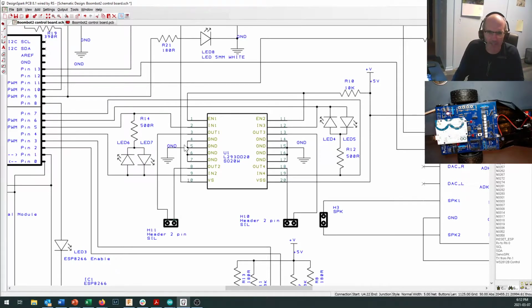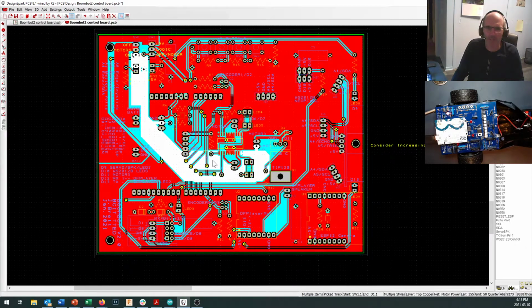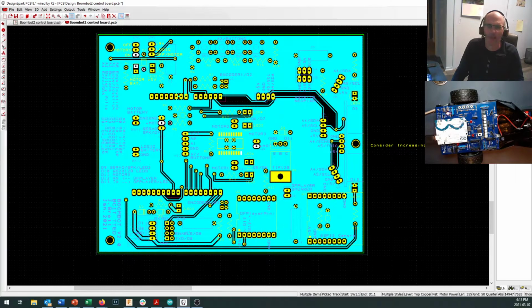That heat, as well as the electricity going to ground, can come out through these pins, and it goes into the ground plane of our circuit board very easily. Now, what do I mean by a ground plane on the circuit board? Well, you'll notice, like I said, I was doing copper fills when I designed the printed circuit board. Let's take a look at some of the layers. This is a two-layer board. I'm going to turn the top copper layer off, and this is the bottom of the board. And I am going to turn the GND layer on. Where is our GND net?